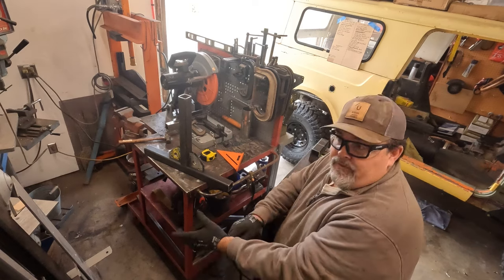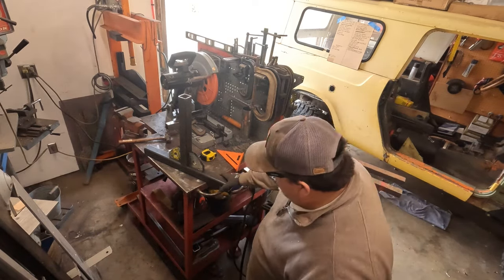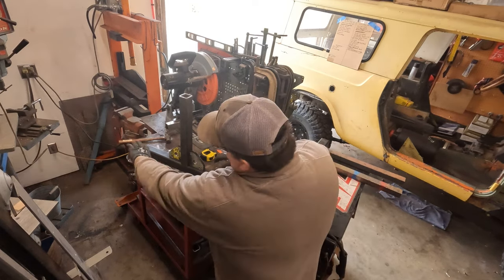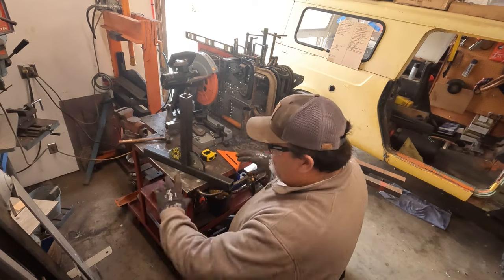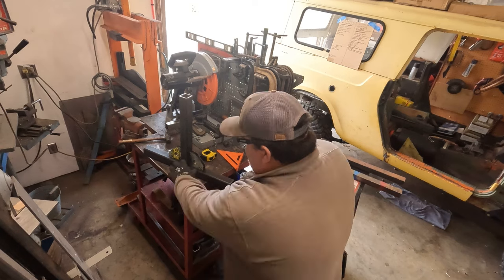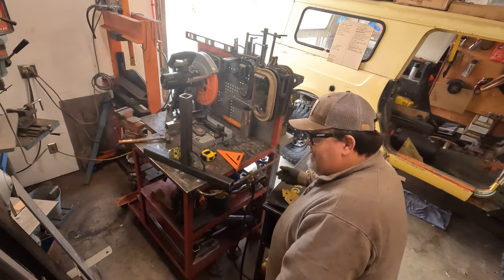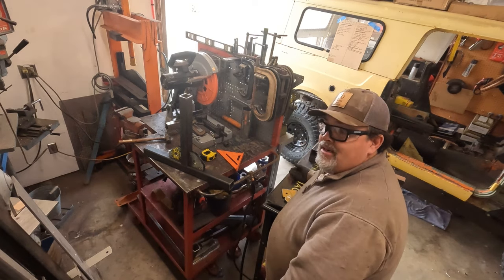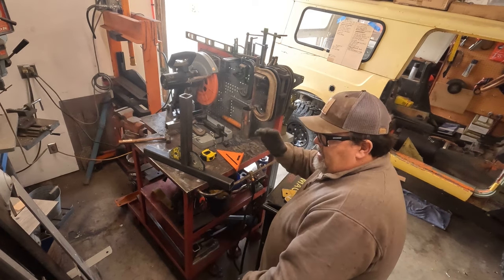I just watched an episode of Fireball Tools yesterday. He was talking about square tube T-joints and how when you make this weld, it bows this. For this project, it's not that critical. I'm not going to go to the trouble of trying to clamp it down with a spacer and preload it. But when we make that weld, it's going to bow that a little bit. As you can see with the slip tube, the non-slip tube we're using, it's going to be sloppy anyways. And we can make all those adjustments with our tilt.